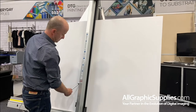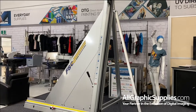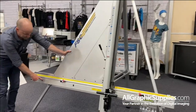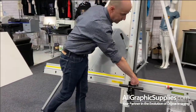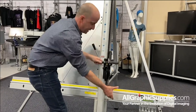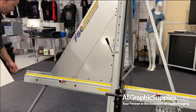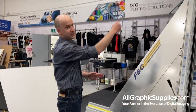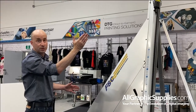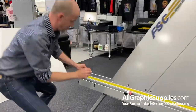So what I do is take out the material. And when you first set up the machine, these screws here in the instructions were told to leave them loose. You don't adjust this one. This is your pivot here, so this is what the ledge pivots on, so you leave those loose. So what you're going to do is come down here, and because your second cut was to the left, that means you have to lower the ledge. If your second cut was to the right of your original cut, that means you have to raise the ledge. So in this case, we have to lower the ledge. And it was just about 1/4 of an inch.